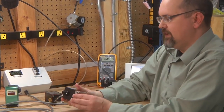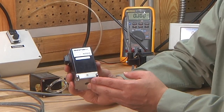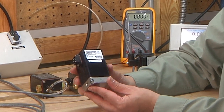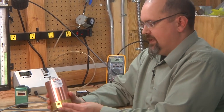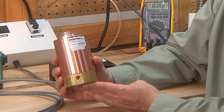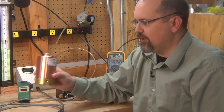Other models are available that have all stainless steel wetted parts. This can be useful if you have materials that require chemical compatibility, or for applications that require higher pressures or higher temperatures. And finally, this GP model is used for high pressures. This model controls 0 to 1000 PSI and is available in either gauge or absolute pressure calibration.